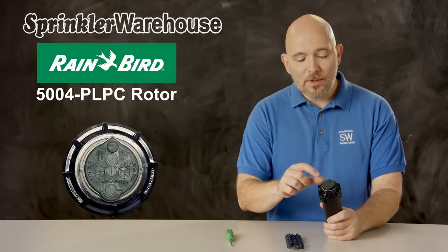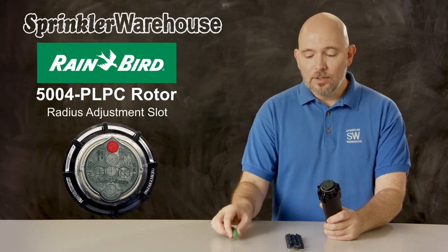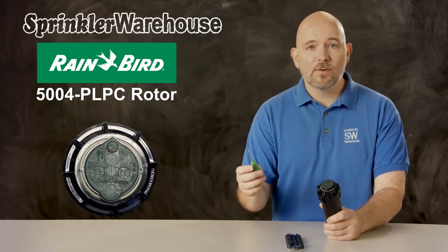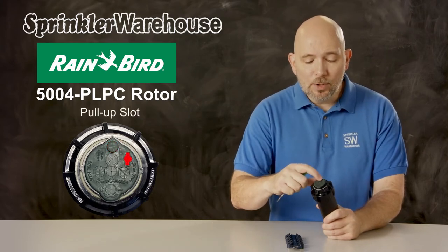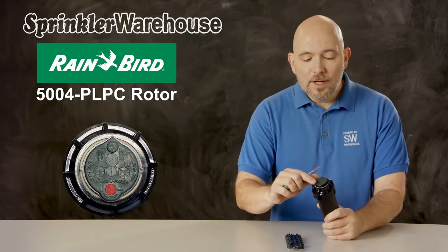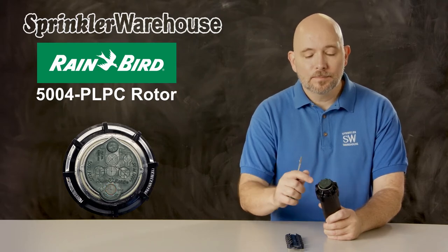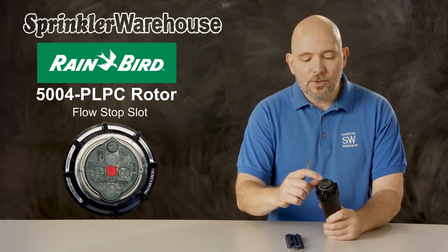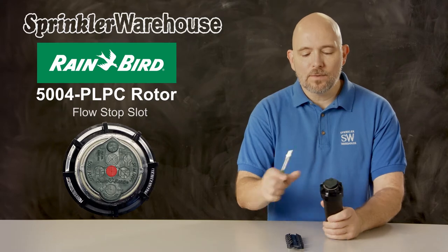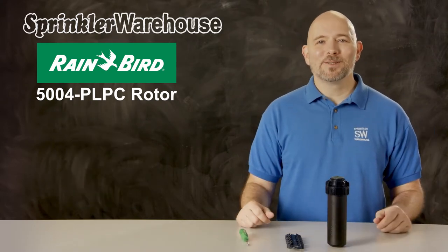Looking at the top of the rotor, this little raised area is where you set the radius adjustment screw. You can use the Rainbird tool like this or a small flathead screwdriver. This is the pull-up slot. You'll need to use one of these for that. Over here is the arc adjustment slot. That's where you set your pattern. And right in the center is your flow shutoff slot, where you turn off the water. Let's go outside and check out one of these in the field.